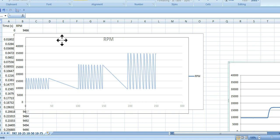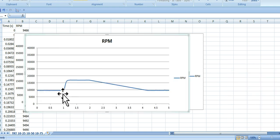This is a little bit of a complicated thing to look at, so I just zoomed in here on one response. The initial part of that is actually pretty easy to pick up. You can see that once the motor kicks, it jumps up pretty quick. When exactly it kicks after you give that command, there's a little variability there. The harder part is up top, because it's not such a crisp L-shape up here. It's more of a curve, a little bit of a sigmoid. Depending on how you set your endpoint detection, there can be a little bit of variability. But ultimately I think we have something that's at least very reproducible, and that's what we're reporting out.